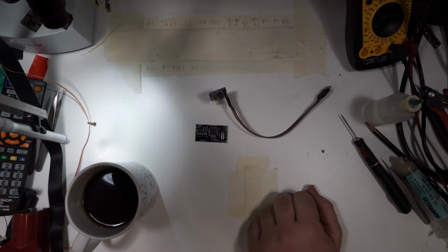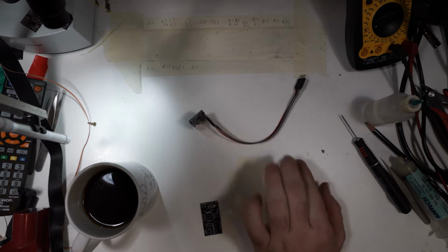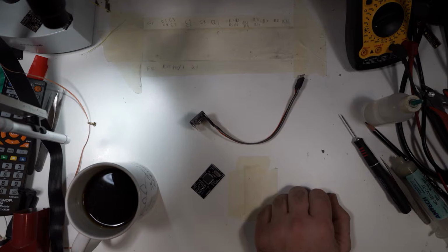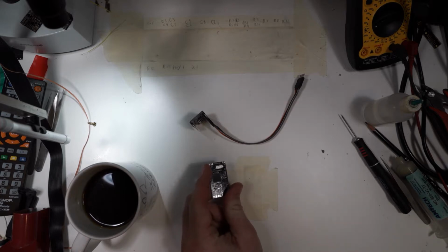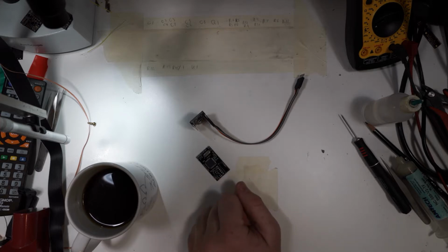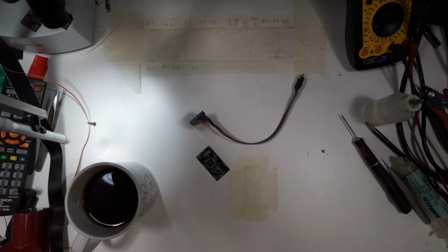It's a real pain. This works every single time, and I think the main reason is that this is signaling at 5 volts, whereas the Raspberry Pi GPIO, I think, signals at 3.3 volts, which is, I mean, the chip is designed to be programmed at 3.3 volts, but the Raspberry Pi GPIO is probably just not optimized for doing JTAG. You know, it's not buffered in any way. It's not meant for JTAG programming. That's just not what it's for. You can make it work, but it doesn't work very well.